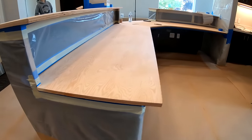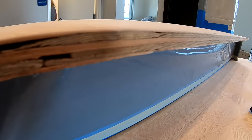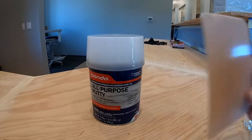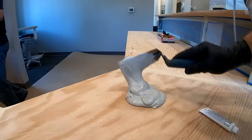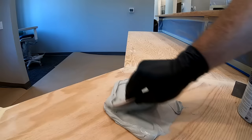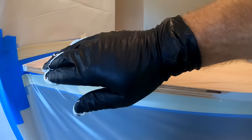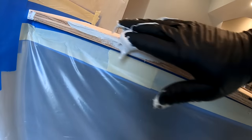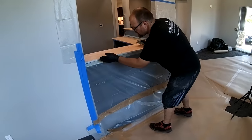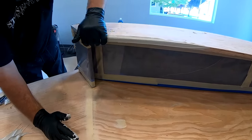This project we're coating plywood, but you can go over MDF, laminate, Corian, cultured marble — you can go over anything with Stone Coat. Next step, we're going to prep the edges. I can see the plywood edge has voids and the seams need to be filled, so I'm going to use Bondo to do a natural edge — a rock face edge by hand. I'll add a little bit of hardener, roll that into the material for a nice even mixture, then use a gloved hand to push it horizontally into those voids and make the edges look like stone. If you're not sure, practice on a sample board — you'll be a pro in five minutes.